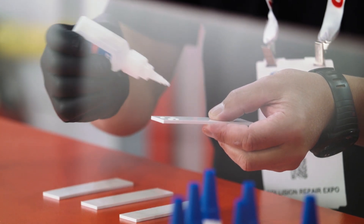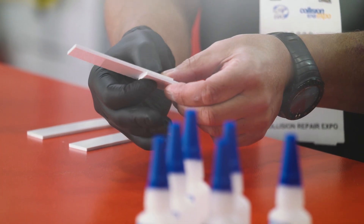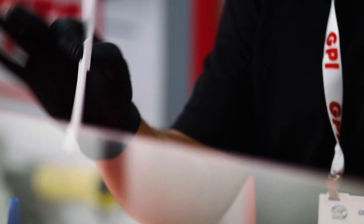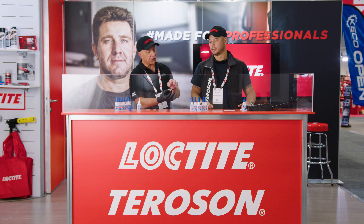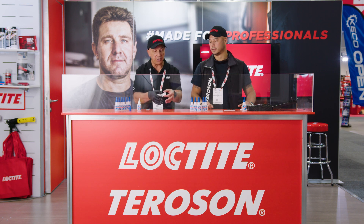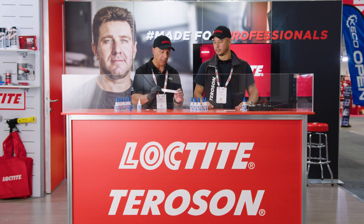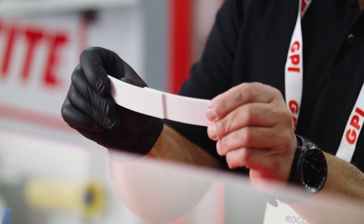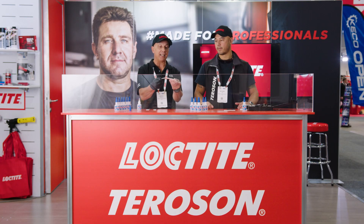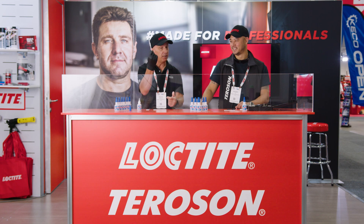I've literally applied four drops of this product on this piece of plastic, and I'm just going to join the two together. Now by bringing the two together, I should get an instant bond within seconds. Now, as I discussed, they're not gap filling. Great tensile strength in a CA, great shear strength, but they don't have much peel. So whenever you're bonding two components together, just make sure you're using the right adhesive, and contact your local Loctite application engineer for the actual result. As you can see, bonding two bits of ABS plastic, fairly sturdy — if I was to continue to pressure these apart, I would end up literally breaking the plastic because the bond is very, very strong.